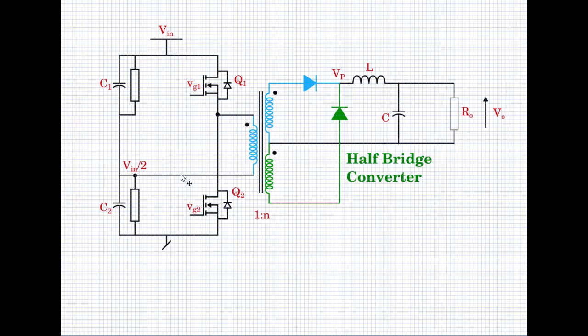The primary of the transformer is one single coil — not two coils like in the push-pull — connected across the bridge. Such a bridge is called a half bridge, because instead of four switches as in the full bridge, you have half the number of switches. The operation is pretty simple. Q1 and Q2 must be mutually exclusive — you cannot have Q1 and Q2 simultaneously on, as that would cause a virtual short circuit through the supply.